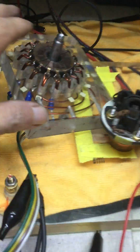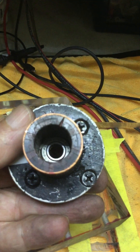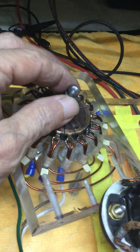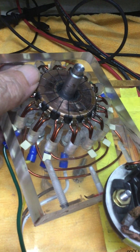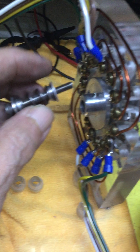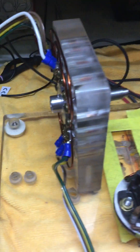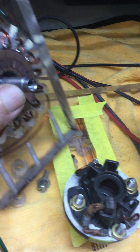So I took it apart. I've built it in a way that this has got a ball bearing inside. It mounts very tight on this fixed shaft and it goes here. It's got a thread — I built this piece in my lathe and it goes inside the commutator very tight and comes to the outside. Then I built this rig here with a bolt and a nut so I can adjust and pull the brush to give it more tension towards the commutator, with adjustments as well.